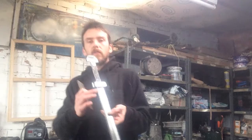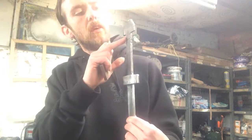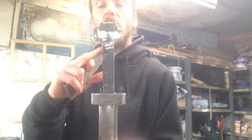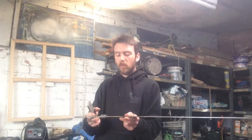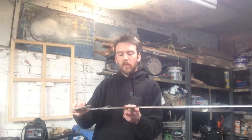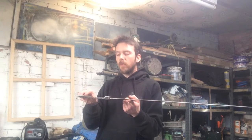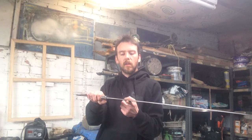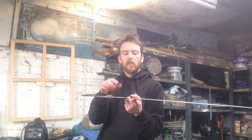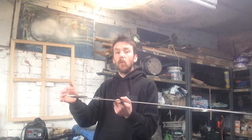So I drew a couple of marks to mark out hypothetically how far I intended to move it from the position where the bottom of the upper guard will be, and then half inch further along the actual sword itself. And ultimately, what I've discovered, quite surprisingly to myself, is that if the balance point is about a hand's width from the crossguard now, if I move this half an inch further forwards so that it fits very nicely against my hand itself, balance point only shifts 5 millimeters or so towards the point end of the blade for maybe twice that distance movement of this amount of weight on the pommel itself.